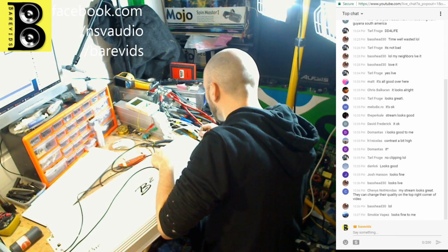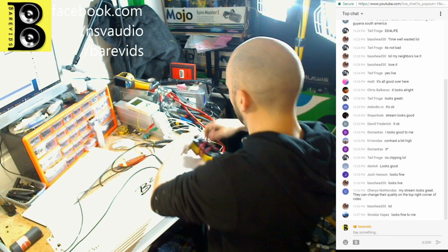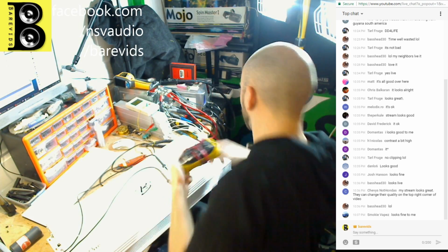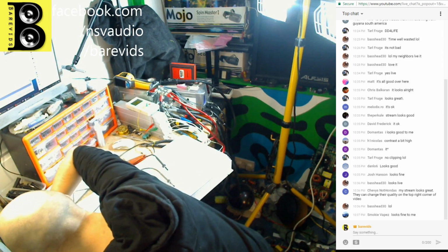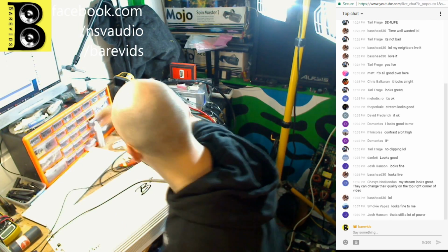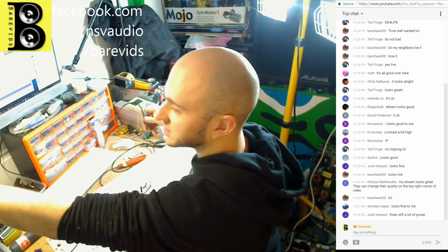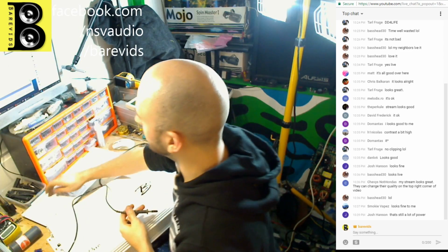So we're now wired into 1 ohm on the dummy loads. Just to confirm that, I'm going to take my multimeter and measure over the speaker output. Yep, we have 1 ohm on the right hand channel. So, right hand channel, let's remove our left input, just stick with the right, and get our little gain turny upper. There it is. Let's turn the scope back to run, turn channel 2 off, channel 1 on.